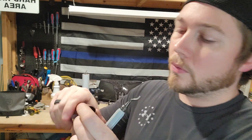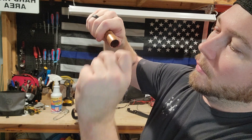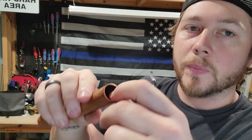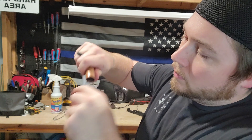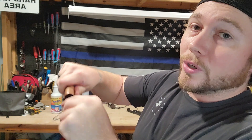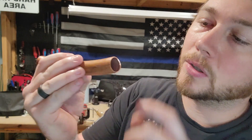First things first, I want to take out this lip from this copper because when refrigerant flows through it, it will create turbulence. The best way to do that is to get a real deburring tool and work the inside of the copper. You can see I'm actually taking shavings out and making it flat. Using a real tool for this makes it so much faster. You can see on the camera I have a nice smooth, non-jagged edge, just like a normal pipe.